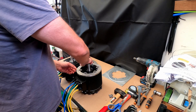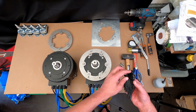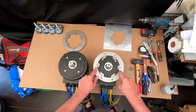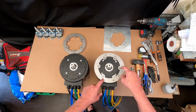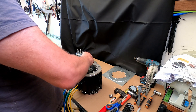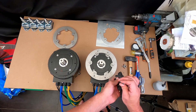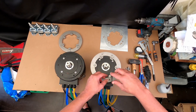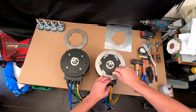Another reason for using these rings is the torque of the motor. Every time the motor starts, it's going to torque like this, and I think that if you didn't have this ring there would be a lot of pressure straight on these holes, which after a while — because it's aluminium — would probably start to wear. So at least now the pressure is going from stainless onto these stainless points here, rather than directly onto the motor housing itself. It will make more sense when I put these rings onto the actual motor.